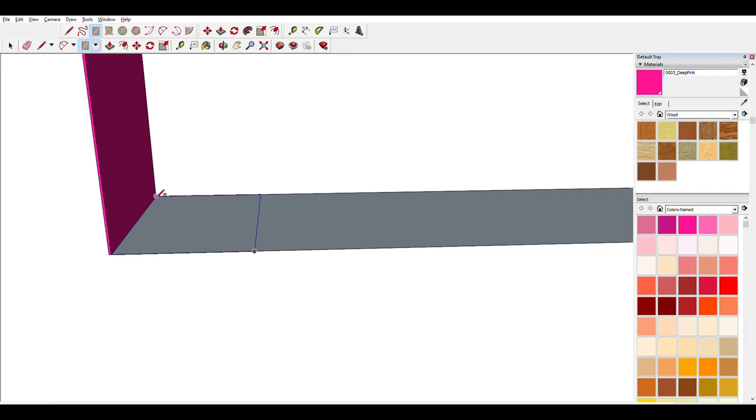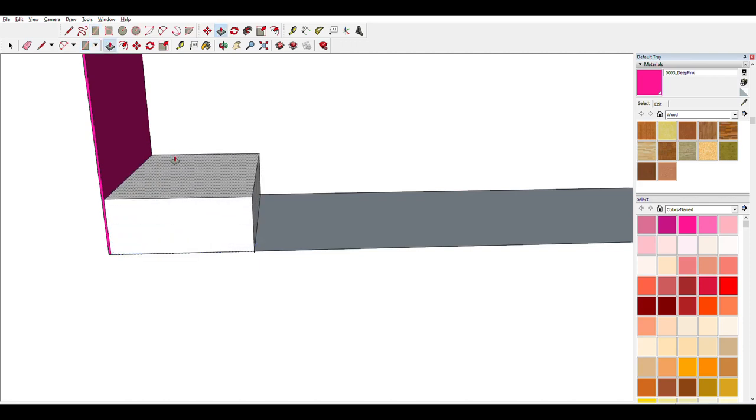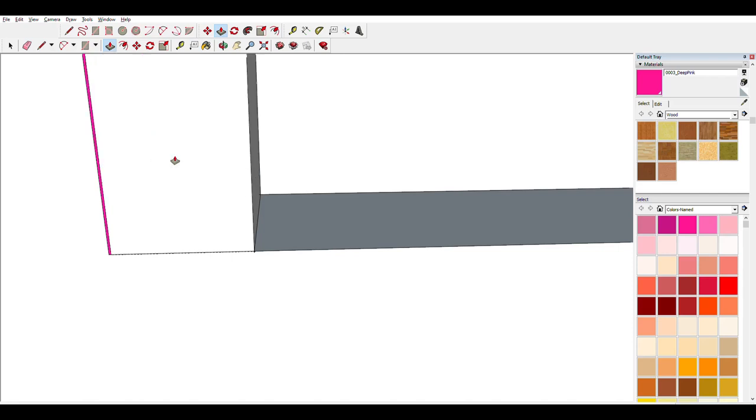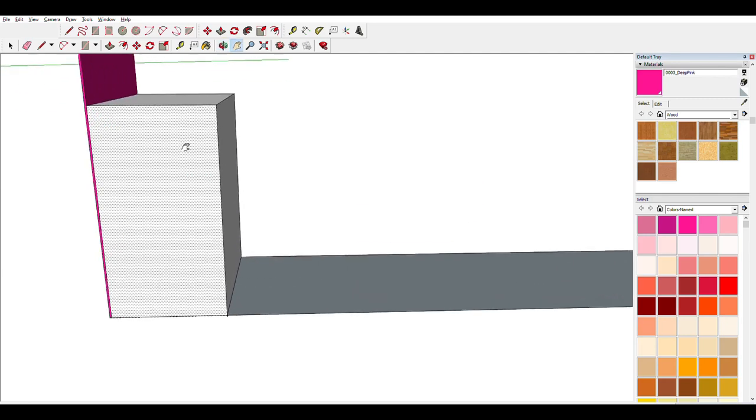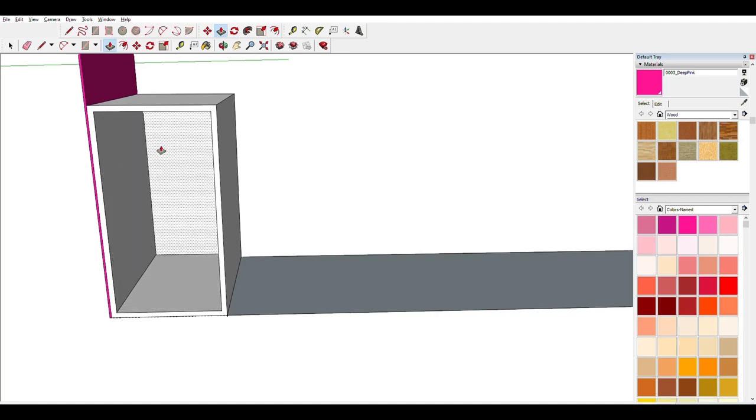And it's going to be done in two carcasses. That's worked out at 394, because obviously we're less than six. So it's 394 by 600 there. And I know, again from memory, that's going to be 720 tall. So that's essentially a carcass that I'm going to build, out of 18 mil moisture resistant MDF that I'm going to spray. So I set an offset in of 18. I'm going to put 10 mil back on, so I'll just rebate there very crudely, very quickly to 590. So it includes a 10 mil gap, back, sorry. Turn that into a group.